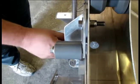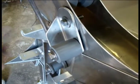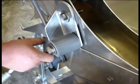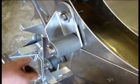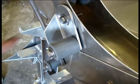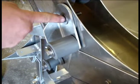And you want to get it to where it's snug and it's a little stiff. And then what you do, you just take and just loosen it up a little bit, just enough to where it moves freely. And basically there, you can see it's falling back on its own. And that would be the correct tension on that nut. And then that'll help with the tensioner pivot point sticking.